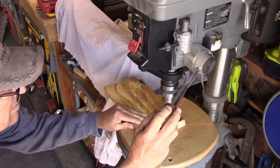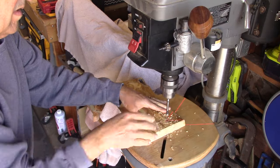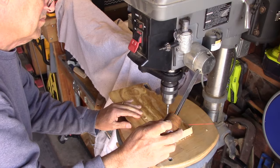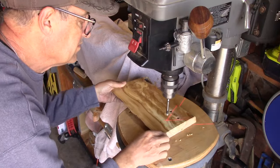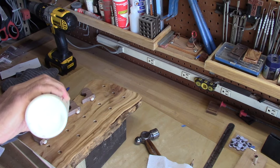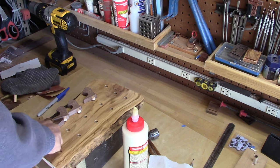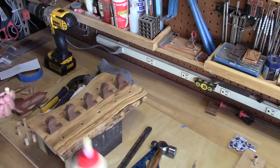Now I have all my markings on the front side. I'm going to drill 3 and 1/8 inches down into each of those holes that I marked earlier with the template. I can do this quickly because I just follow each of the lines as I go down. Then I put a drop of glue on the end of the dowel, cross the bottom of each nose, twist it and get it down into the nose hole. As I do this, I put a ruler next to the noses to make sure they're all straight up and down.